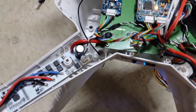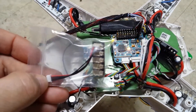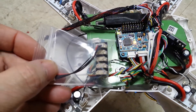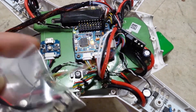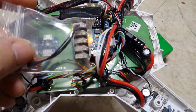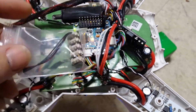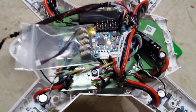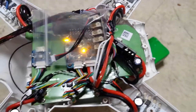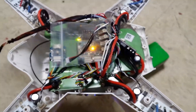The other thing you need is an I2C bus splitter to make this work, because all Pixhawks only have one I2C bus — especially the mini Pixhawk. Once you adapt it to plug into the mini Pixhawk, you have four ports for I2C: one for driving the LED board and USB, and another to plug the stock compass in directly. The stock 350 Pro compass wire will go between the compass and that breakout board and plug right in without splicing any wires — factory-style. All of that will go inside here; I'm going to have to build out and fill this area like I do with the OSD to give me more room.